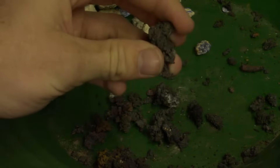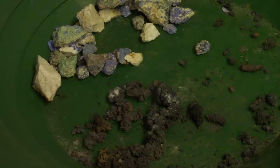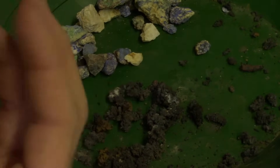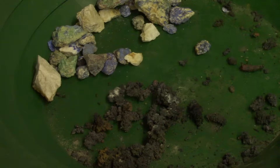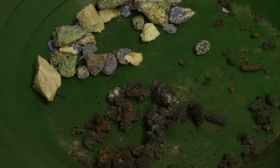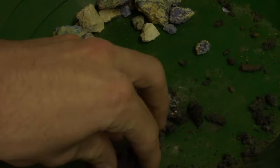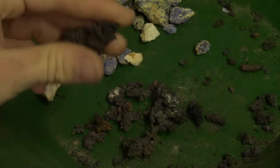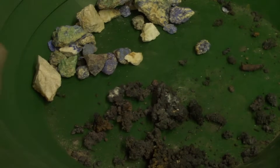We have terrible quality soil here, and as soon as it got hot it dried out the soil and turned it into just a dusty powder where you can grab it and chuck it in the air and it just dusts to the wind. So as soon as it got hot and with me blowing on the bellows, all the air probably just blew all the dust and was smothering the fire coal bed. A lot of my charcoal when I dug it out, even after sitting there for about three or four hours, there were some charcoal pieces that were unburned, which shows that a lot of it was smothered out. So it didn't get as hot as it should have — it was an incomplete process.